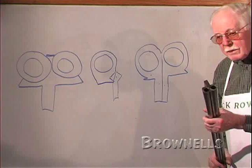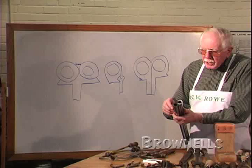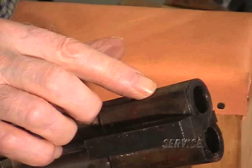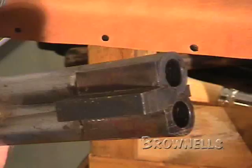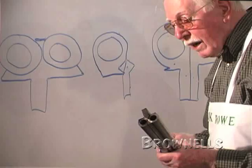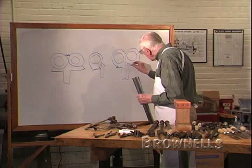You can see this lump is rather thick and there's extra metal around there. The next stage after this would be machining, and this lump would be machined down to near the right thickness. The flats here would be taken down lower and you can even get the bars — those two little parts that stick out — machined sharper. They would also drill the extractor hole, which is there, when they do the machining.